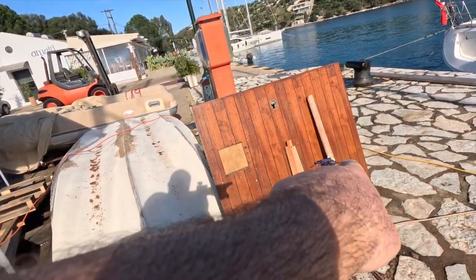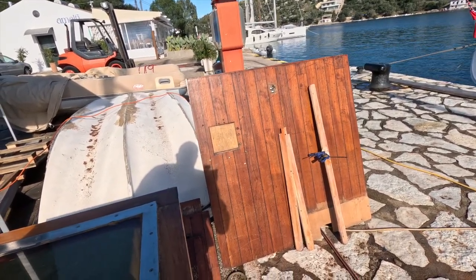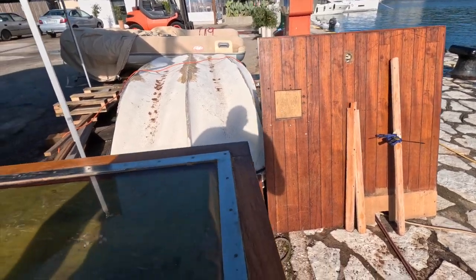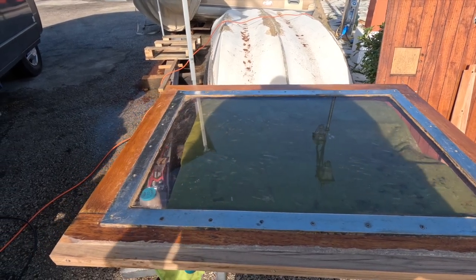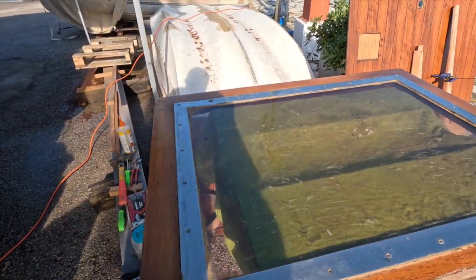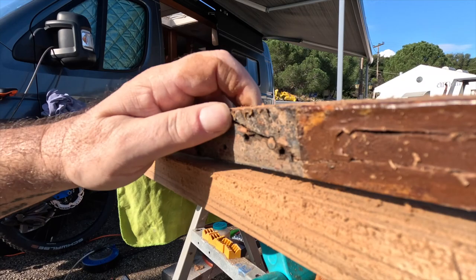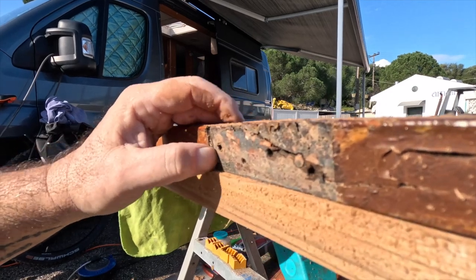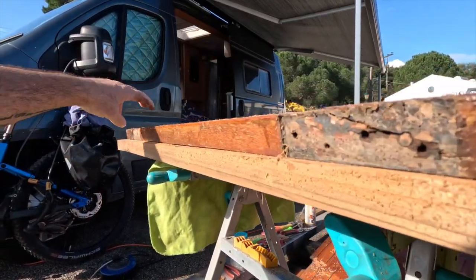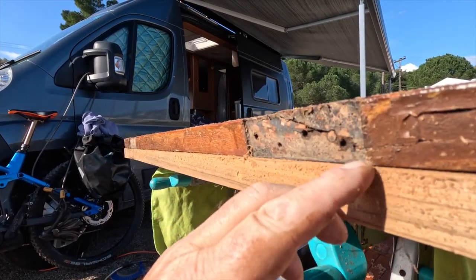I have to put the side pieces on, so those pieces there need to go back on the sides, and then once they're all screwed and glued, all this can be sanded down quite nicely. I'll prep the outside, I'll also prep the inside, although I'm not going to varnish the inside just yet, but I will prep it because it's easy to do it now with all the pieces off. And new and the old, obviously this bit being the old section, which was badly broken. I need to mark the hinge rebates, and I'll use the router just to take a shaving out of this.